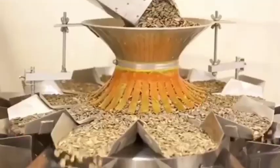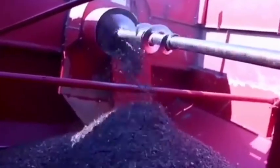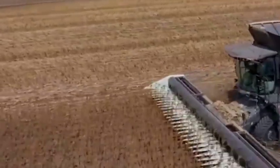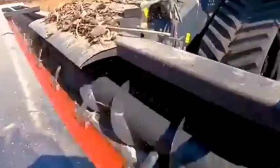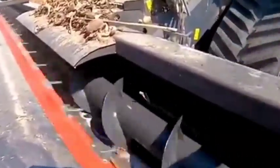Mechanical pressing. The conditioned sunflower seeds are pressed to extract oil. In local manufacturing, a screw press, also called an expeller, is commonly used. This method involves crushing the seeds under high pressure to extract the oil. The remaining seed cake can be used as animal feed.